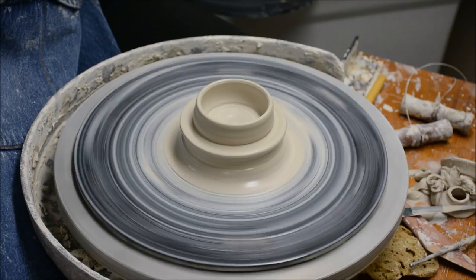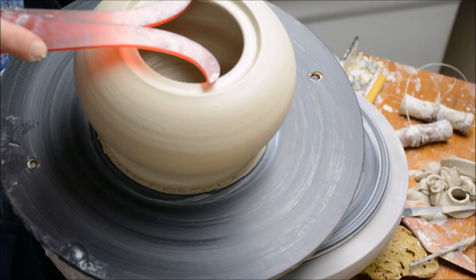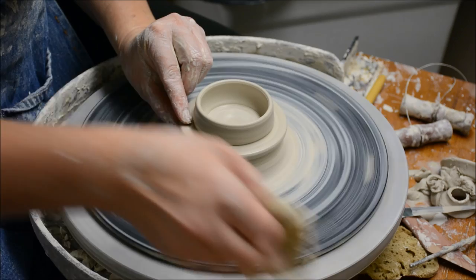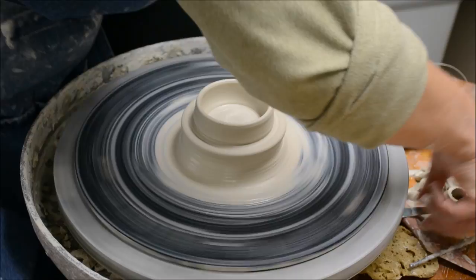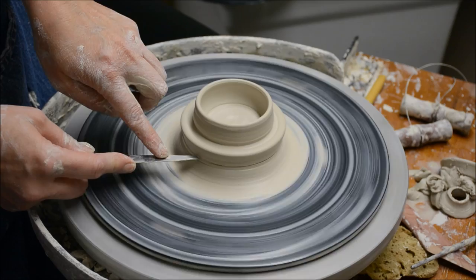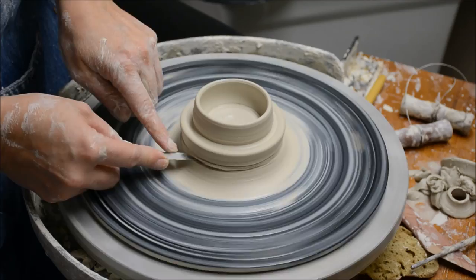The other measurement I need is the gallery itself — how big the flange is. I'll use the calipers to measure the internal gallery, and then the lip of the lid will need to fit with that. Right now it's just a little bit bigger than I need, so I'm going to push that in and compress that rim. It's just a smidge bigger, but I'll go with that. When I cut this off, I want to be careful not to cut through the bottom, so I'll go a little lower and cut almost all the way through but leave it attached in the center.